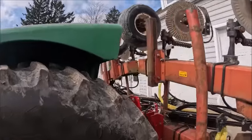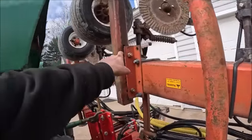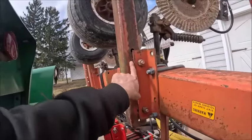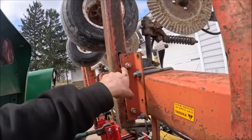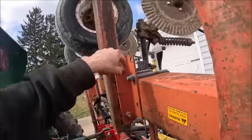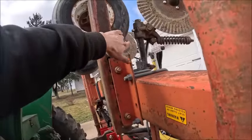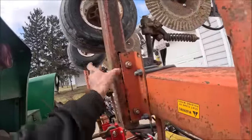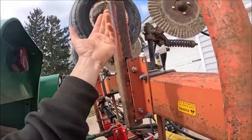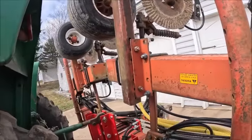So basically, what I was able to do, there was enough meat in the box tube that rather than making spacers and having to make more parts, I was able to offset the holes. So basically now the bolts are skirting the back web of the box tube, and there's still plenty of meat in between the holes and everything, so for what they're doing, they'll be fine.